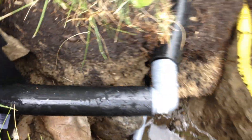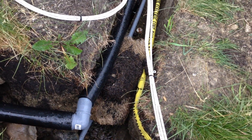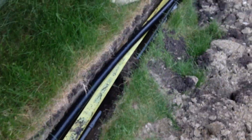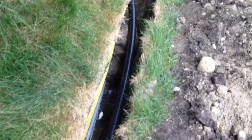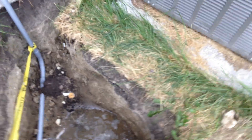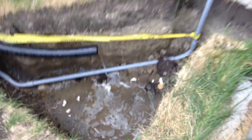I'm connecting it to the two-inch line as a very temporary solution — so temporary that my elbow is just barely touching the two-inch pipe. I've added a few pieces of sod into the trench to test the height and slope of the line. Here is the location where the large sump basin is going to be installed, and as you can see water is flowing perfectly.